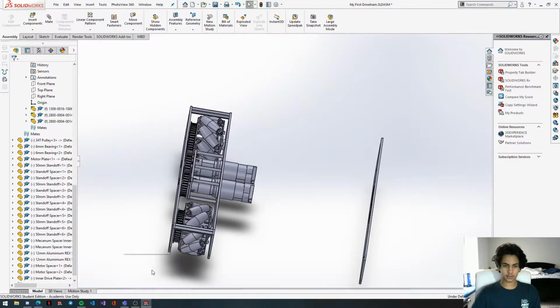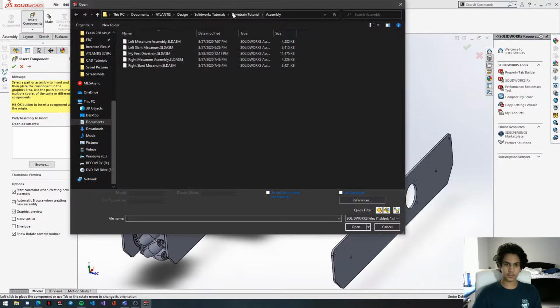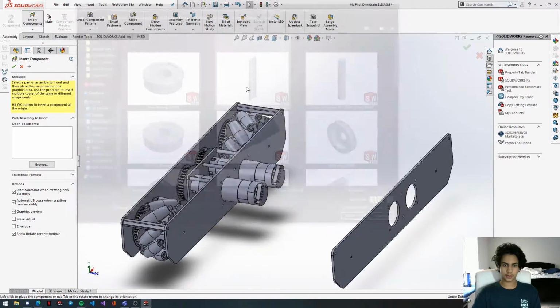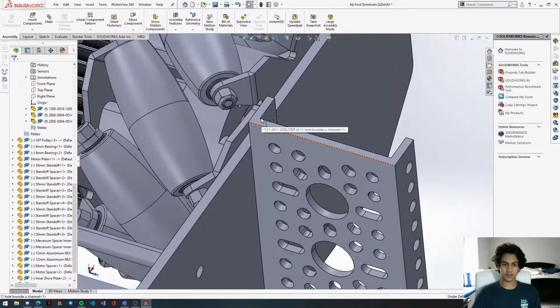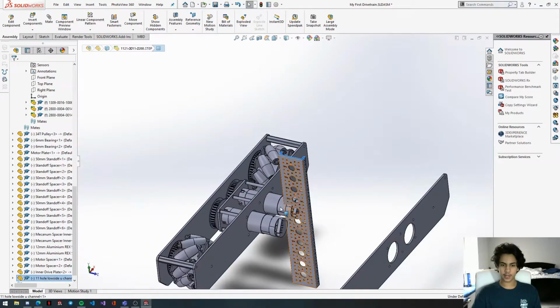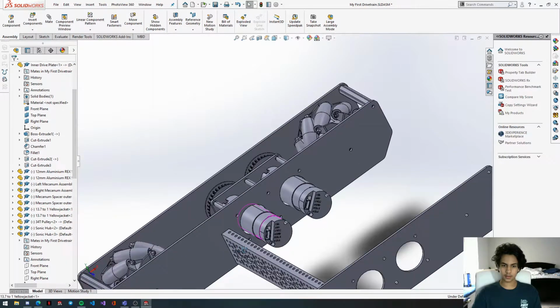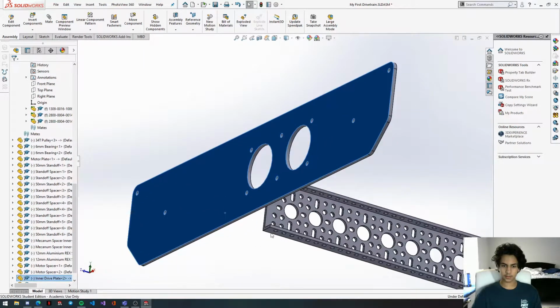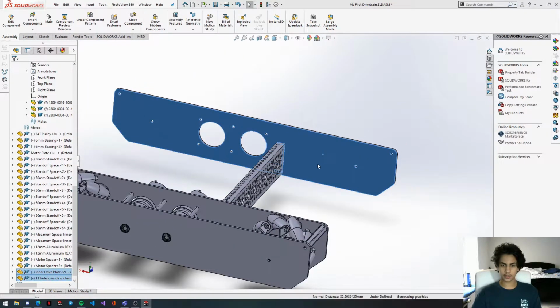I'm going to close and go back to our tab over here. First, we're going to import our channels, and we're going to use those to attach these two plates together. Where is our channel? Here it is. Okay, so we're going to grab this face right here, and then we're going to get the interior face of this plate, and then coincident them together. And then we're going to get the opposing face right here, and then get the face of this plate right here. And this should lock these plates from moving.